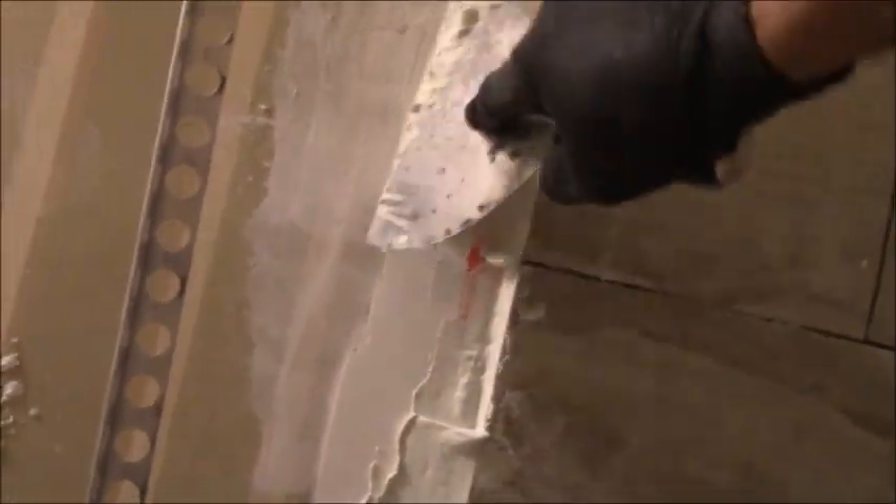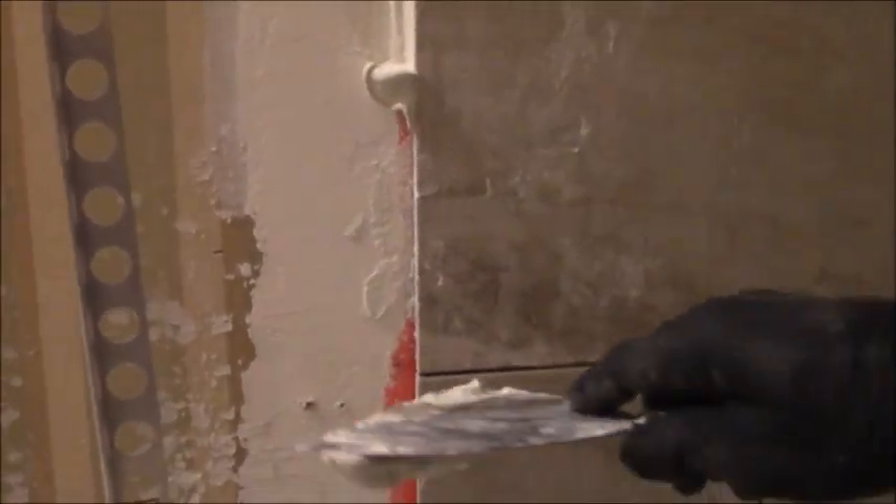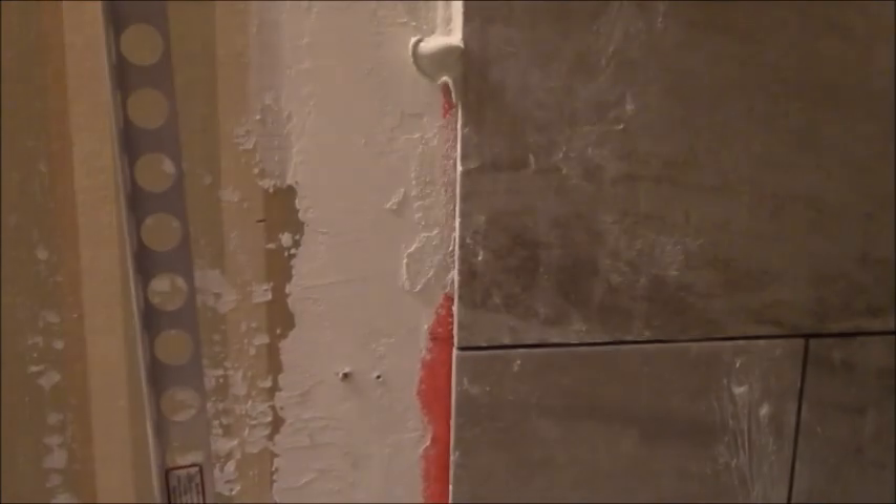It's just a very easy, foolproof process. The only other thing I suggest is that if you have a straight starting line on your wall — whether you start from the top, middle, or bottom — each and every single tile must be cut exactly the same size. Even a sixteenth of an inch off is going to show up when you put your transition on.